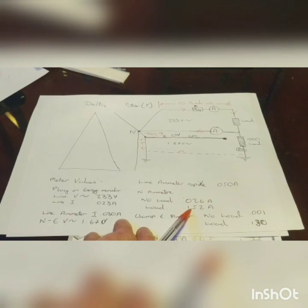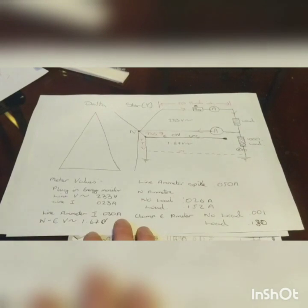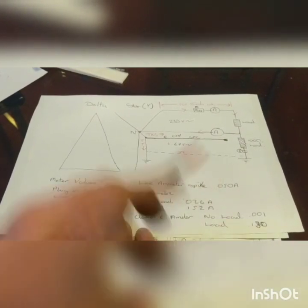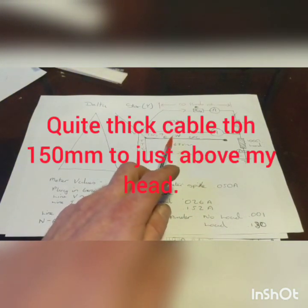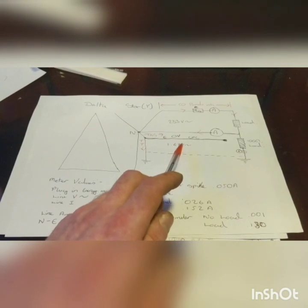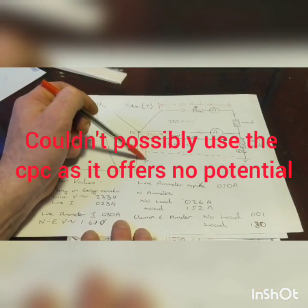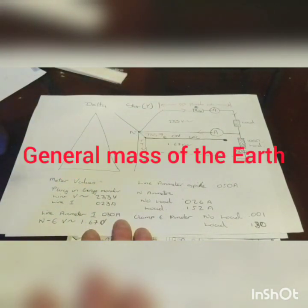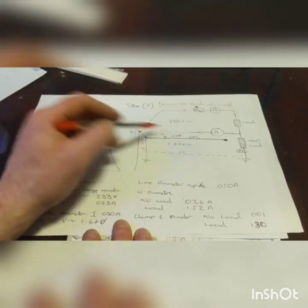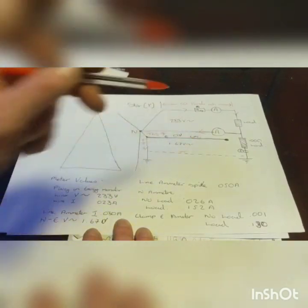I'm unsure of what the inductance is on 50 yards of a neutral cable on its own going down what we call here a TT system, which basically means it has no earth — it uses a spike, or a piece of metal connected to the ground — as opposed to a TNS, which is the way the system is set up properly, using a cable to give you your earth.